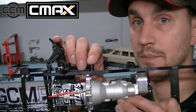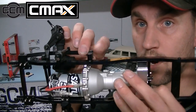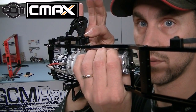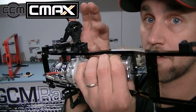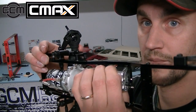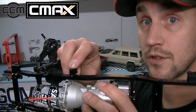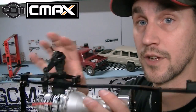We have the thread depth on the swing hanger set exactly so that when you have the washer in there and the screw is tight, then there's very, very little movement here. There's a tiny little bit of wiggle in order to get you the flex compression that you need, but the swing hanger is free in the frame, nice and free in the frame. So bottom out the screw here, and please, if you so desire, put some thread locker in there.